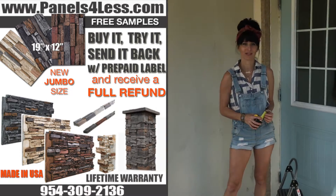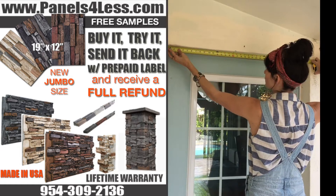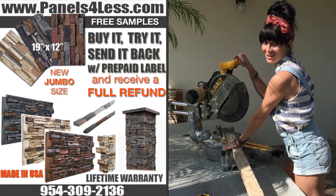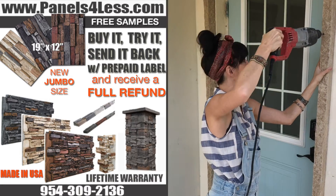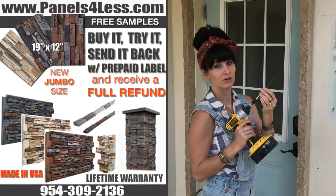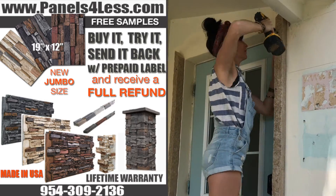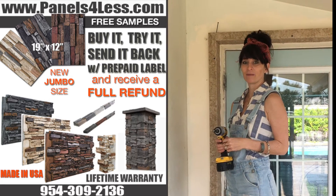If you have doors and windows, you want to install your trim and ledges first. Measure from inside to inside so you can get the most accurate measurement for your miter. Use a chop saw to create 45-degree miters for all your corners. Pre-drill the holes into the concrete through the material with your hammer drill, then take a two and a half inch exterior screw and drill it through the hole to secure your molding into the concrete. Make sure you screw the two moldings together where they meet so the joints stay tight.